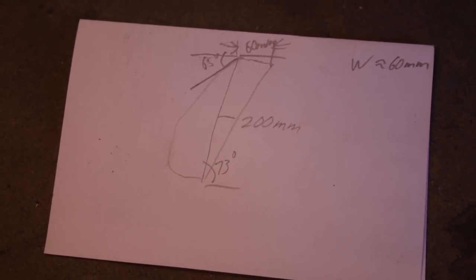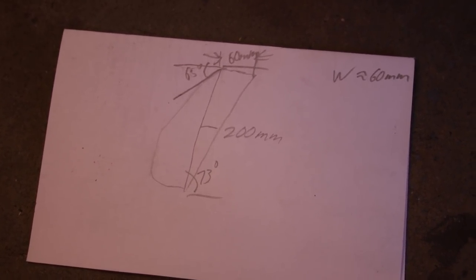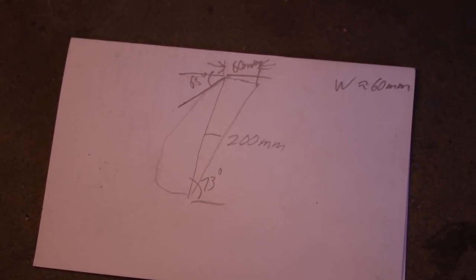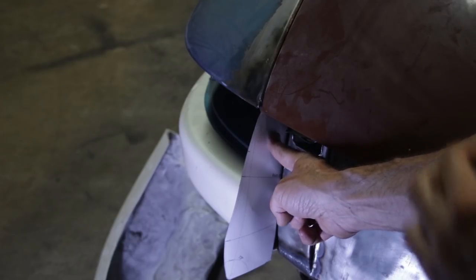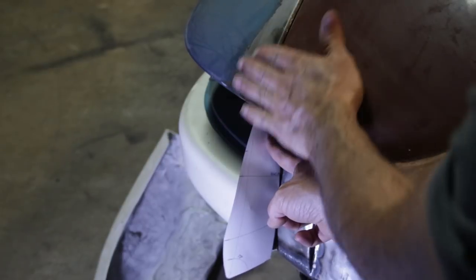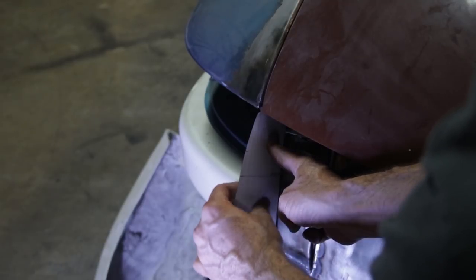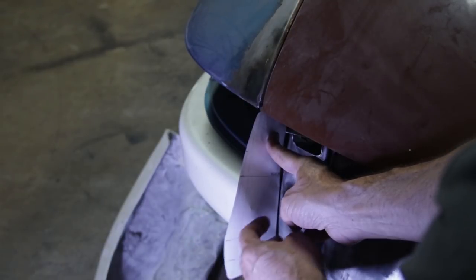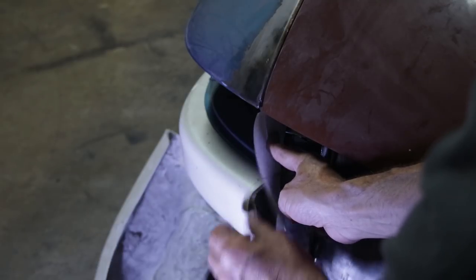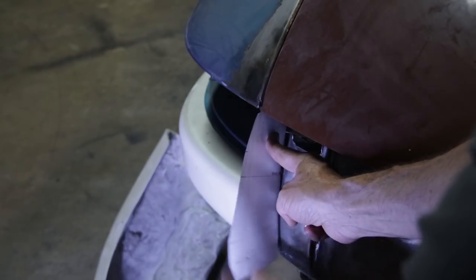Here are a couple of quick notes — this is pretty messy, but I'm going to take it to the computer before I forget what all these mean, and try to sketch something out, then overlay it on the car and make sure it's in roughly the shape I want. Okay, here's iteration one. Some parts are good and some parts are way off. This angle here is good, but it's sticking out way too far here — this needs to be brought in to be more in line. We don't want it sticking out more than this far. It lines up well with the license panel and the deck lid — just have to reshape all that.